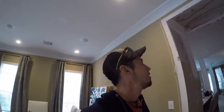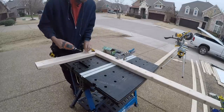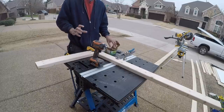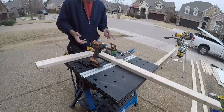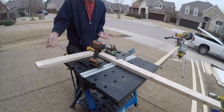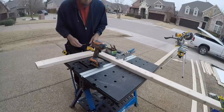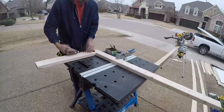To do this top part, we're just going to pocket-hole it together. The exact depth we need to come down is an inch and a half to get to seven inches — and that's exactly what 2x4s are. We're going to put this up laying flat, not like typical joists, because this isn't structural at all. It's just to bring down our depth so we'll be even with the other two cased openings.